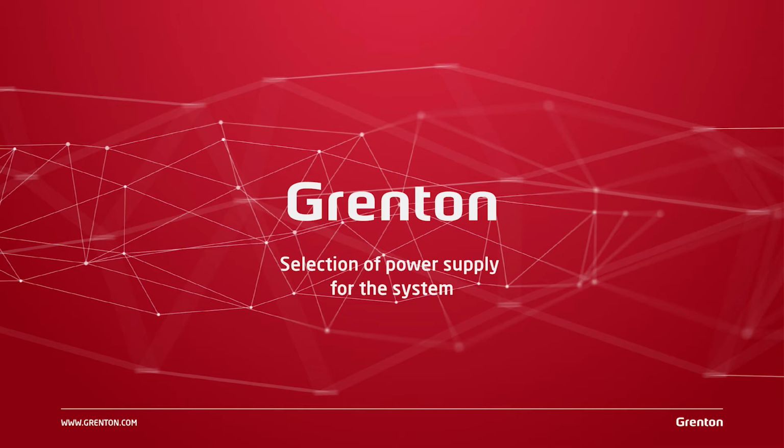Let's move to the power supply and start from the basic issue, i.e. the method of choosing the power supply. The system, in order to work properly, needs to be powered with the appropriate voltage. And here, not only the size of this voltage matters, i.e. 24 volt DC, but also the power supply that is used to power the system must be well selected to cover the current demand of all modules which will occur in the system.